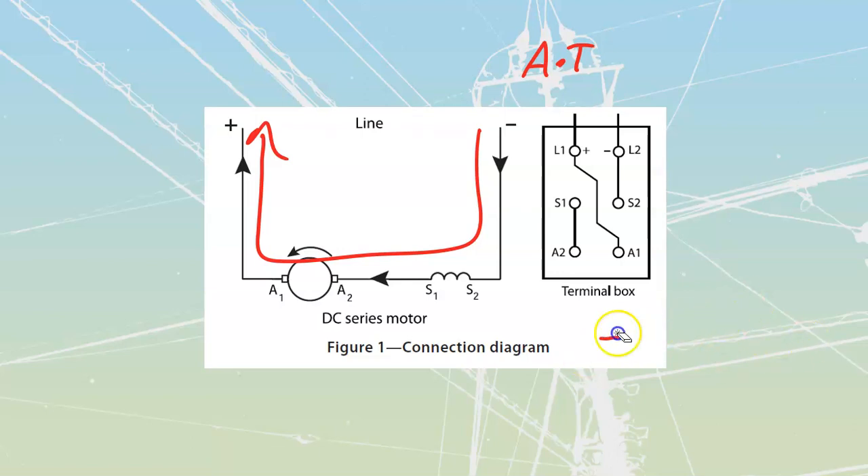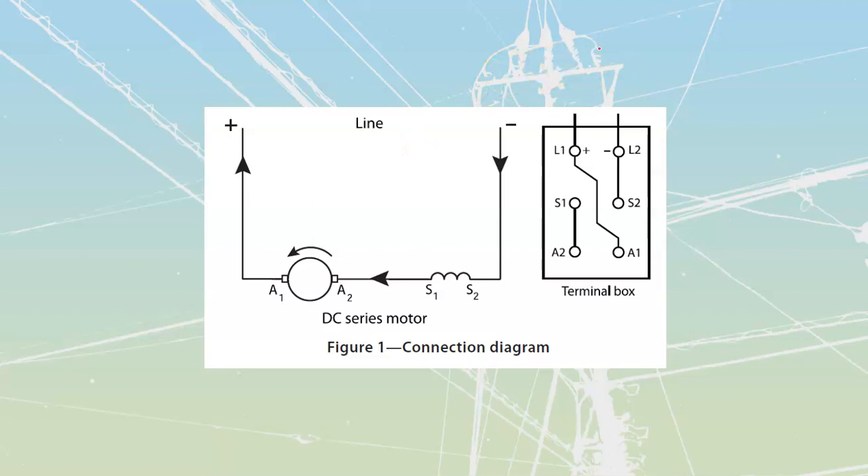Our connections are going to look like this. Note that the textbook shows a counterclockwise direction of rotation, but everything up until now has been clockwise. I'm going to overlay this with a clockwise rotation - I'll reverse this direction to maintain consistency with previous learning tasks. There's nothing wrong with their connection; it just differs from our shunt ones. These are NEMA standards but they're not applied uniformly throughout this module, which causes unnecessary confusion for students.